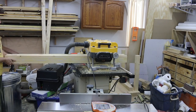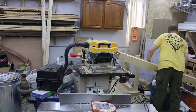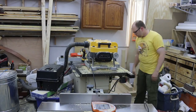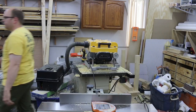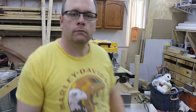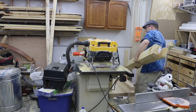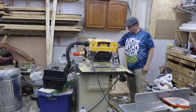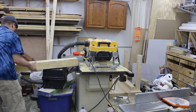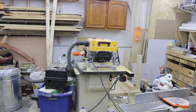Once those sub-assemblies have been jointed on two faces, I run them through the planer to get everything parallel and square and arrive at my final dimensions for the tabletop. Actually, I'm going to glue these sub-assemblies into larger sub-assemblies and then plane those down to final thickness. This was another day — you can see the change of clothes and the very physical type of work.